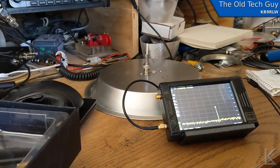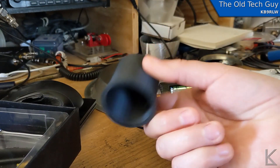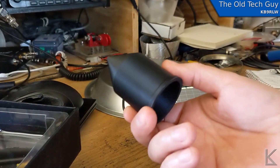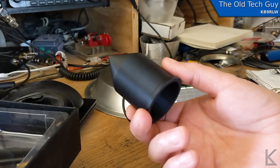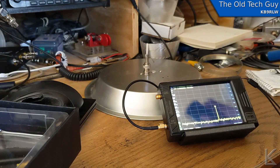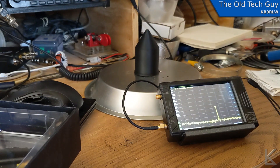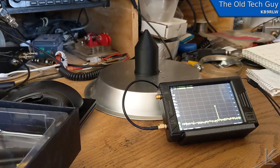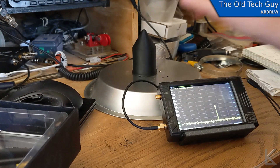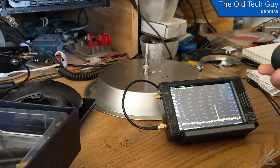One final test to do. I have printed this shield — it will go down over the antenna. This is 2mm thick magnetite-filled PET-G. We're still sitting at our baseline of negative 57 dBm. I'm going to put the shield over the antenna. It didn't really drop much at all. So as a shield, it doesn't really make much of a difference at all.